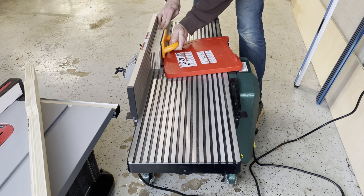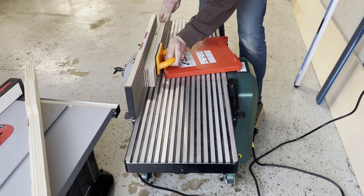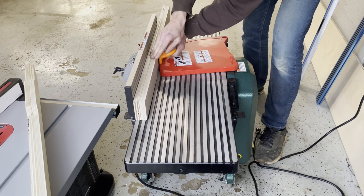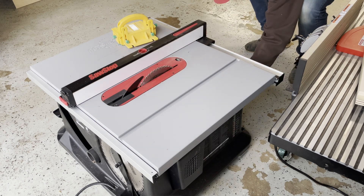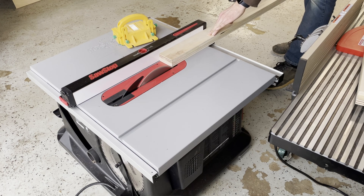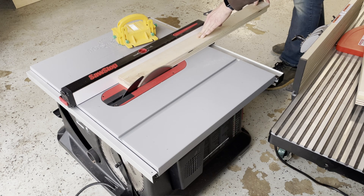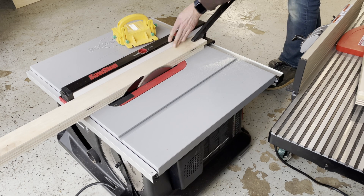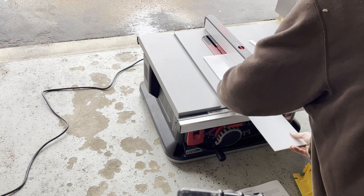I was a little bit lazy and didn't feel like cutting the glue off, so I just ran it over the planer to get a square edge and take the glue off. The piece closest to you is the one you want to be square. I ran it through the planer to make it square, then took it to the table saw and used that squared-up planed side to run a parallel cut, making sure it's square top and bottom. That also helped get rid of the glue.